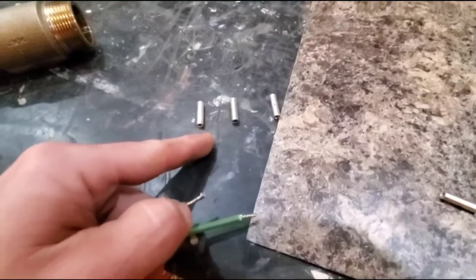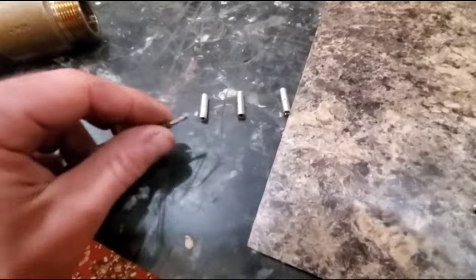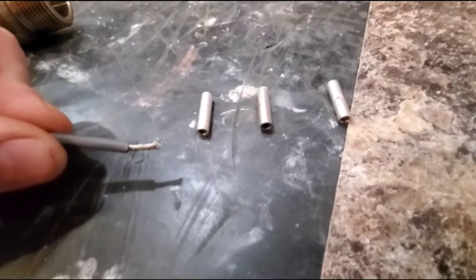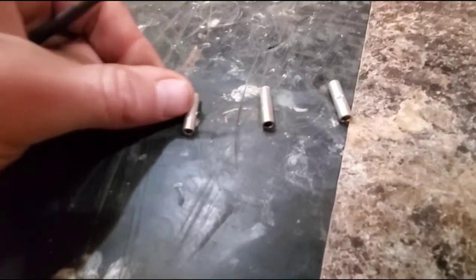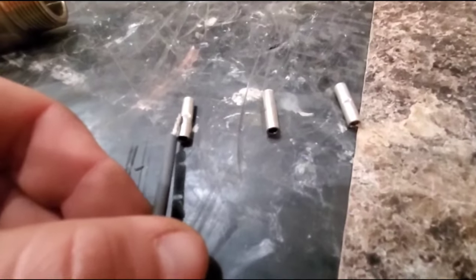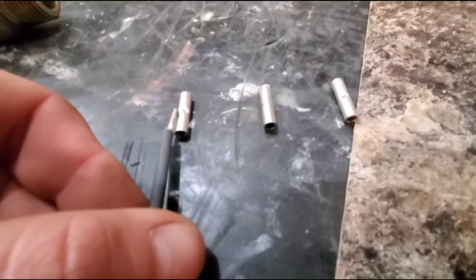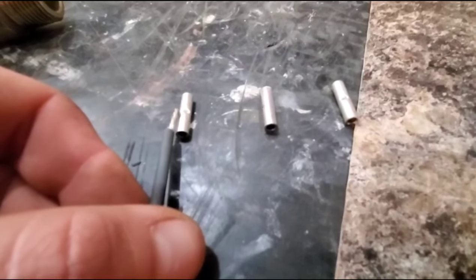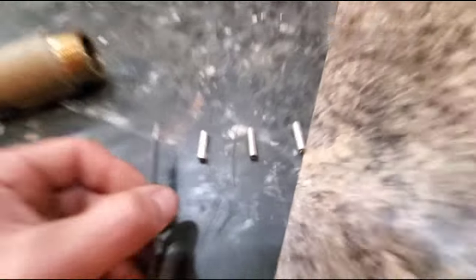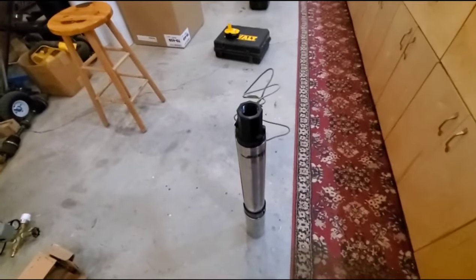I have to put on these stacons — the lead wire crimps. What I like to do is twist my wires; you can see those are twisted. Then I cut them to the length that is needed — they don't need to be any longer than that, because that will help when you go to make your waterproof connection.